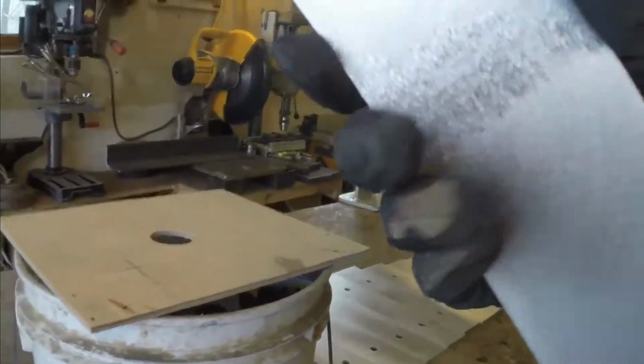Now this got the ends cut, the ends sanded, and then I did a few mechanical processes to it. So there's probably just a little bit of heat in here. I want to let it set and cool before I do anything else with it. That way, it has a chance to go back to room temperature, and I'm not chasing a bad tuning. If I put a lot of heat into it, the bar will go flat. It will get larger, it gets longer. When it is hotter than it should be, anything I do to it will be false. So I just waste my time. So I let it set. That's the way to do it.